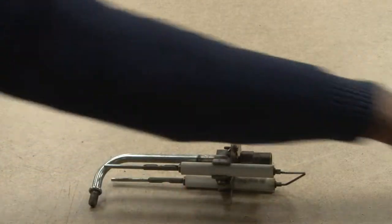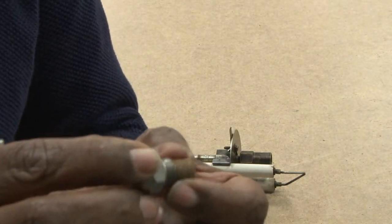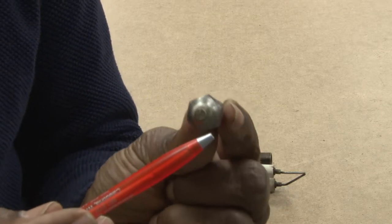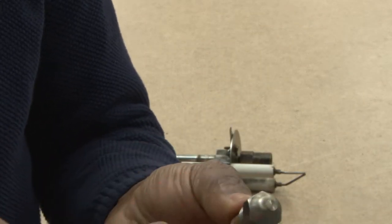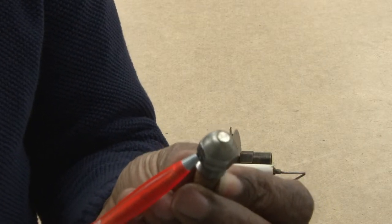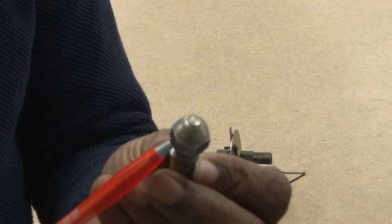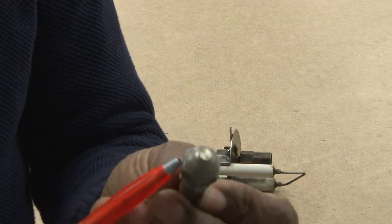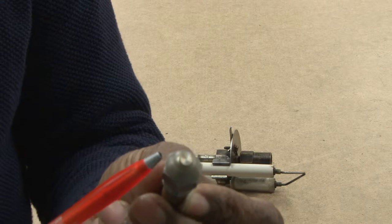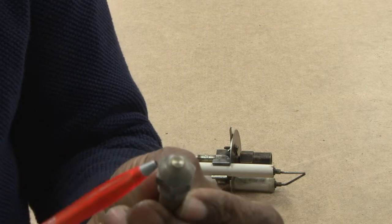From that point we will have the nozzle. This nozzle is designed to create a certain pattern from a small orifice. There will be information on it — for example, this nozzle is rated for 0.5 gallons per hour. At 100 PSI, by maintaining that pressure, it will generate half a gallon of oil. If you consider that one gallon of oil is 140,000 BTUs, this nozzle will create about 70,000 BTUs per hour.